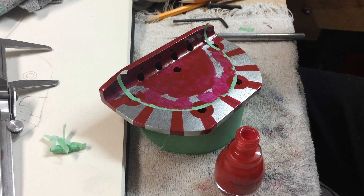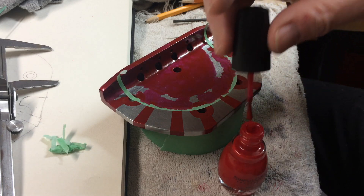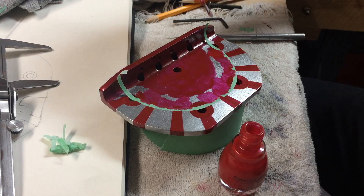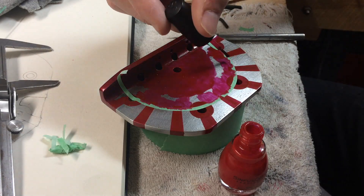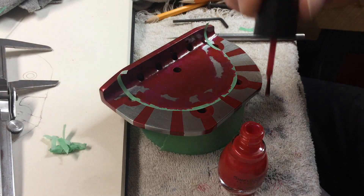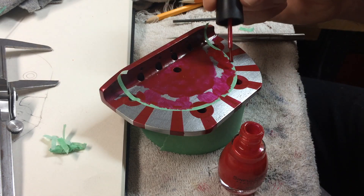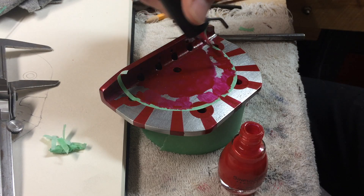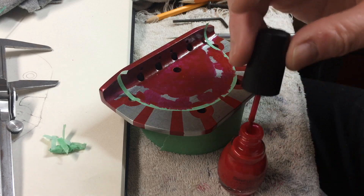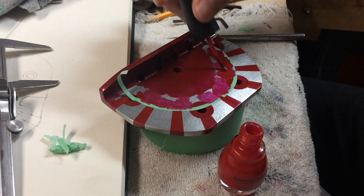Okay, my first coat. The nice thing is nail polish dries super quick — dry enough that I can put a heavier coat on now. It has to be thick enough so that when the saltwater and electricity touch it, it's not going to go through. I noticed on my first ones that any little pinhole or light area, the saltwater and electricity got through and actually etched a little pinhole — I'm going to try to minimize that as much as I can.